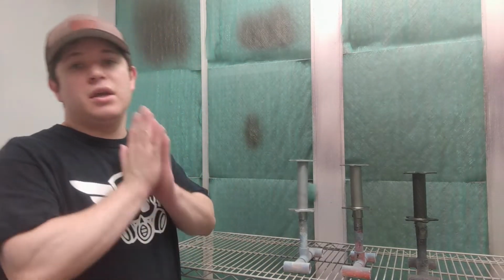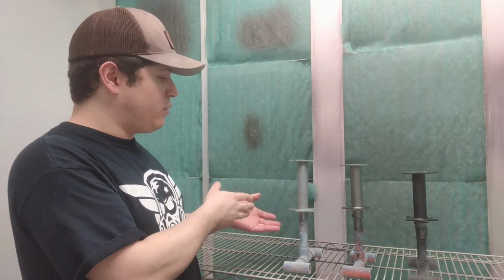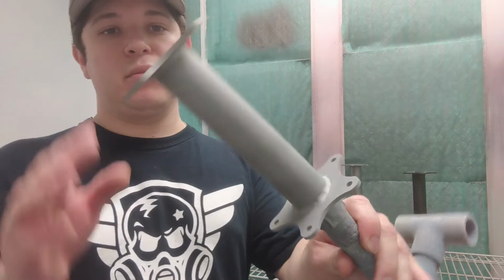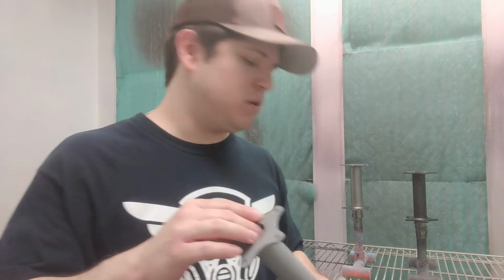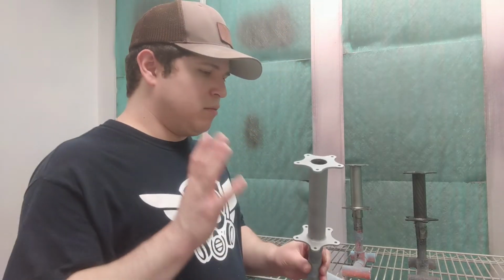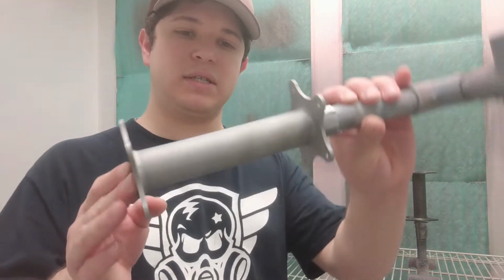But anyway, to explain, hydrographics is an ink print that is chemically etched and bonded to the part. So, basic to explain that is we have a part. So this is a sandblasted part. This is I think a steering wheel extender, I think for off-road or racing or something, but forgot to have a basic one. So they basically come to us raw, and then we have to apply a texture on the parts, that way the paint will stick to it. So for these metal parts, we sandblast them, so it's got a nice sandblasted finish.